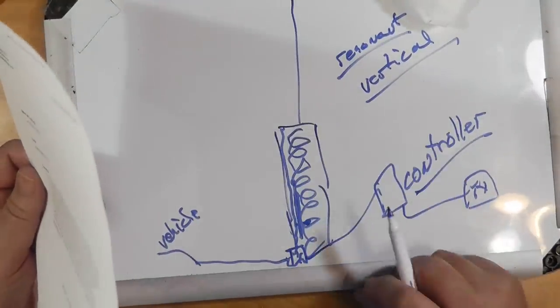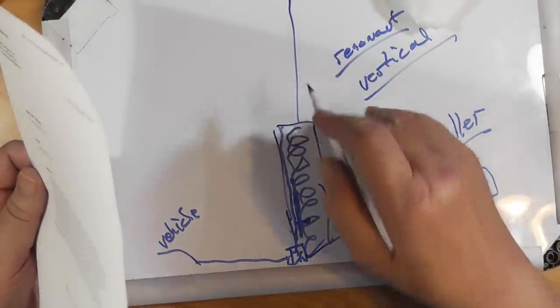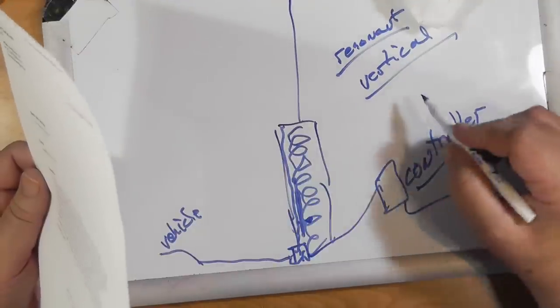The screwdriver is a really wonderful antenna. It works very well and acts like a full-size vertical. However, note that it is heavily loaded, which means it has high Q — the quality factor. It's a scalar with no units, but a high Q means very narrow bandwidth. It will operate only a few kilohertz either side of the frequency you've tuned it to. It works very well at that frequency, but if you go very far away from it, you've got to tweak the tuning.